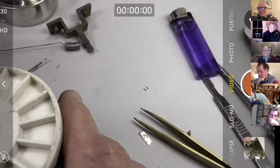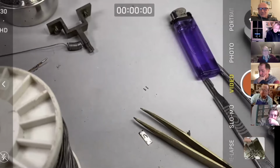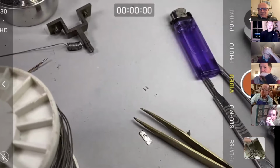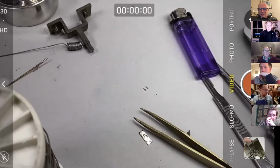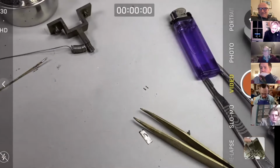Somebody's got a question up there, Rachel. Yeah. Solder on the spring is no problem when you're hardening? Good question. The solder on the spring when you're hardening. The only problem I've found with it is that it sometimes sticks to the wire. But no, surprisingly, well, we'll see. Many a great plan and all that stuff. But no, I just harden it with the solder on. Sometimes it gets round onto the other side, but we're going to stone that off anyway, so it doesn't matter.